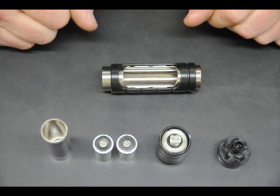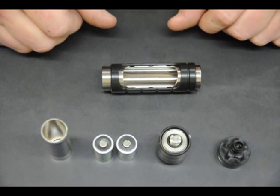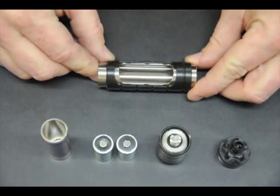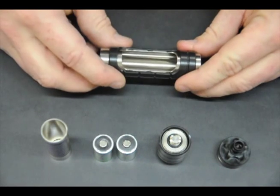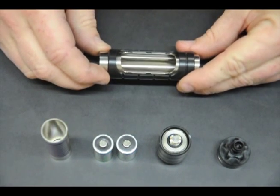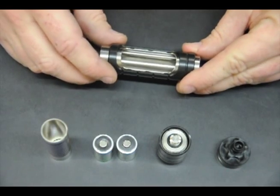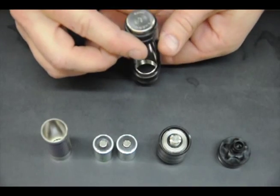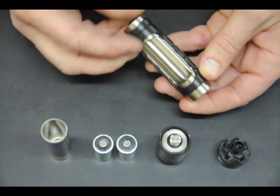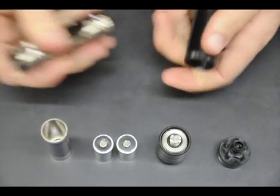This is your first sub-assembly level. You can see it's pretty simple — it comes apart without the use of tools and there's nothing really to it. The Delrin sleeves press onto the main body and the thermal interface parts. This is a light press fit — I designed it such that it could be removed and reinstalled by hand. My preferred method is to put my thumb on the base, grip the Delrin sleeve, and just push it out. So that just comes apart like that.